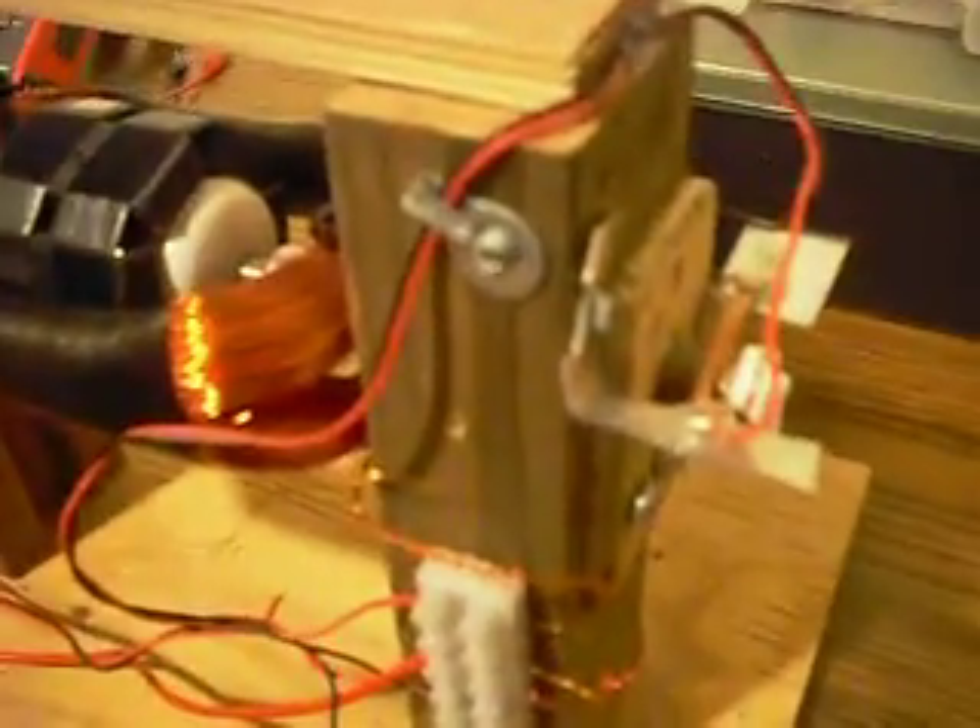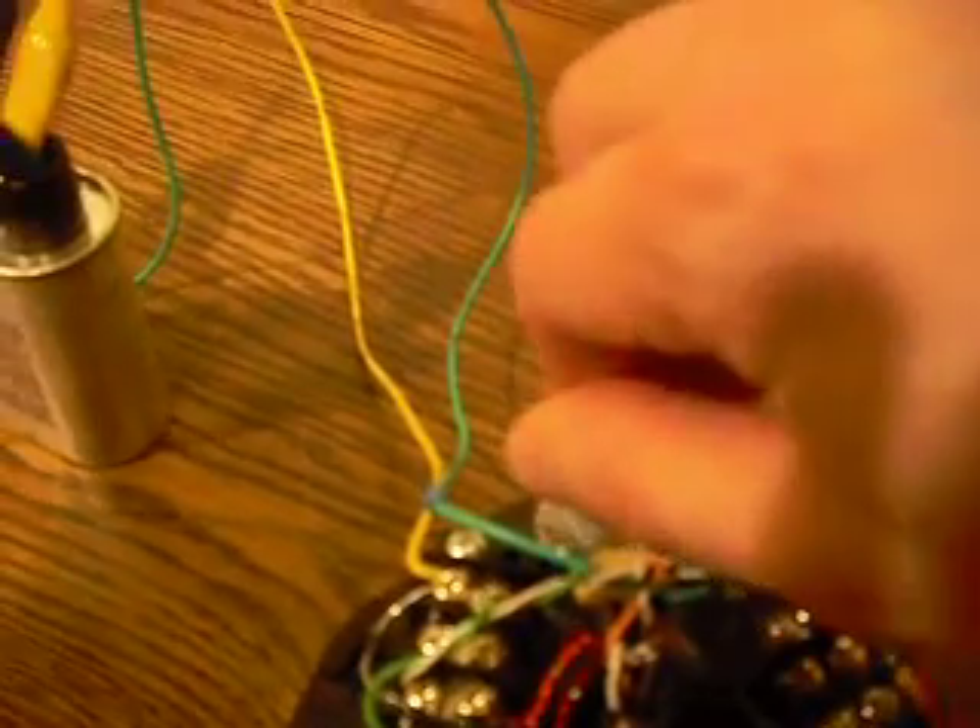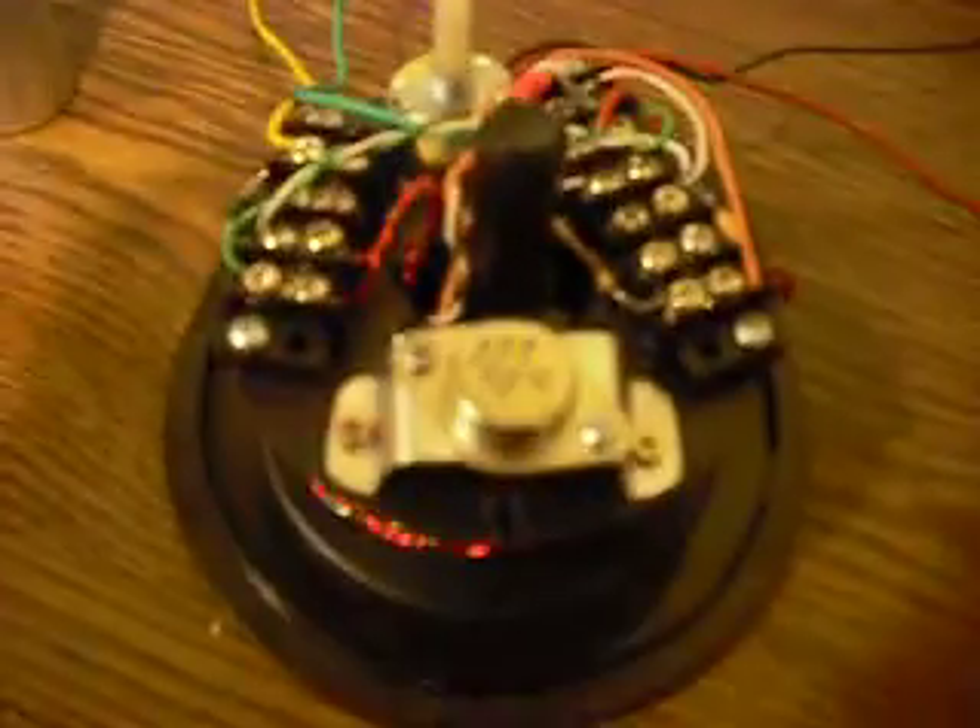We'll start the motor. As soon as the contacts engage, the motor will start. We'll start it at low power — not a lot of sparks. As you turn the power up, you really start sending power to the mechanical commutator. If this was a reed switch, it would quickly burn up. I have tried it, and the reed switch lasted about five seconds with this much power coming directly from a capacitor.